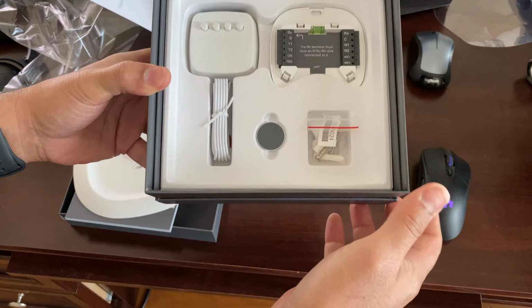All right, first off, before you get anything installed, we need to have safety first. Go to your breaker box and figure out what is connected to your AC and shut those breakers off. This is really important for you to do because this is safety. You don't want power going through your AC or your system. Even though it's not too dangerous, it's a good idea to turn off these breakers. And it's in your instruction manual. Also, go to your furnace switch that's located probably in the attic. Turn it off. And now you're ready to go to your thermostat that's hanging out in your home.